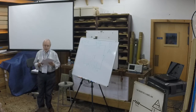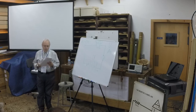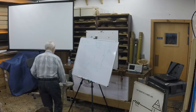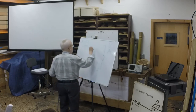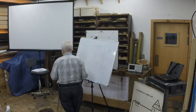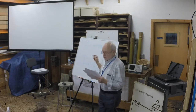Well, how do you figure out how big the rectifier in an organ needs to be? We already touched on this. You need to know how much electricity the magnets consume. Fortunately, it's very simple. Instead of a light bulb, let's draw an electromagnet. The loops represent hundreds of turns of fine wire on the magnet coil.